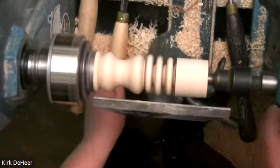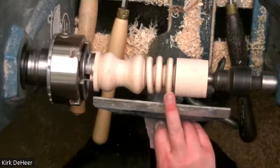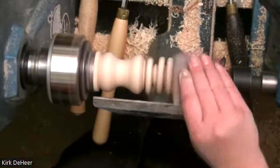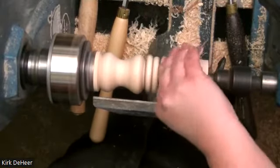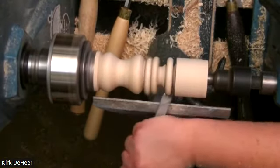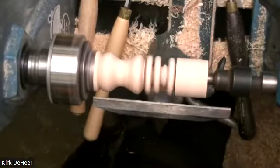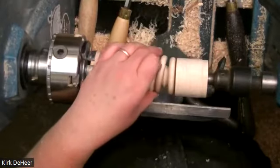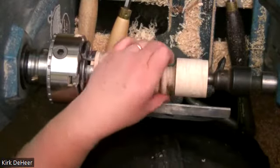I can feel there's a catch in this ring, so I'm going to stop and look at them. You always want to look at your rings and make sure you don't have any catches or gunk in them. It's right there, so we're going to hit this with a little sandpaper again. It's okay to use sandpaper to help you get the shape you want — it's not cheating. It's easier to sand now than after it's parted off. There we go — that one came right through and it's clean. Stop the lathe — never grab stuff while it's spinning. You've got those little pieces inside the ring — just pop it against the spindle, those come right off.